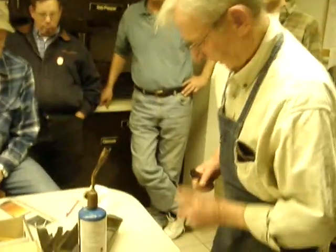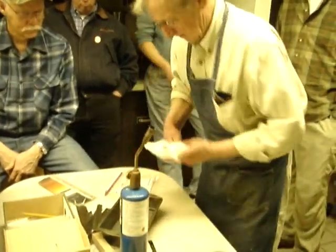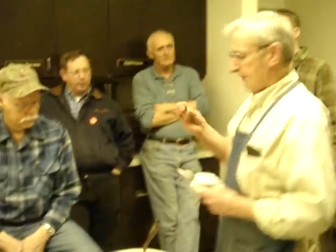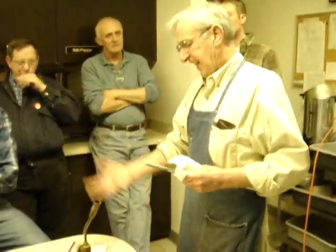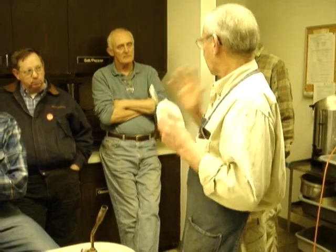Agitated. Kind of like what you do to your wives most of the time. Agitated. Will it tend to harden if you just stick it? Oh, it will, yeah. But what happens is it's just the action of quenching it. It builds up bubbles, and you want instant quench, as close as you can get to that. And with those air bubbles on there, it tends to want to insulate it from the quench medium.